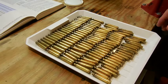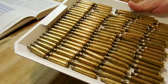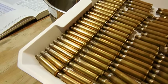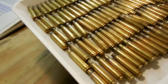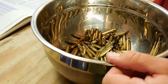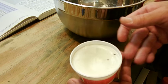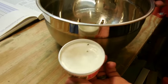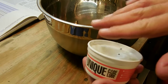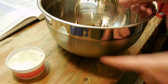We've completed the step of rinsing, washing, and drying the brass, so we've got all of our 556 brass right here — a mixed assortment. The next step is to lube these up, and once we lube them we're going to resize and deprime them in the same step. I take some Hornady case lube — I've lubed a couple thousand rounds and only used about two teaspoons worth. I take just a little bit on my fingertips and run it through the brass, mixing it around so it gets all the cases.